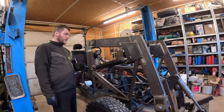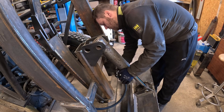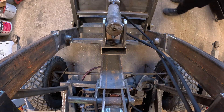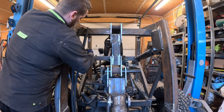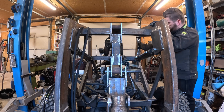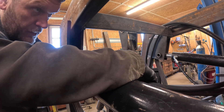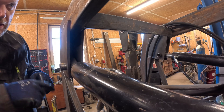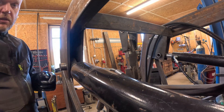I'm gonna connect the front tilting cylinder because that's the easiest. Adapters for the boom cylinders. In order for these to work in parallel, I'm gonna have to connect the front sides to the three-way connector and then to the valve block, and the inner sides also gonna have to connect together and go to the other part of the valve block.